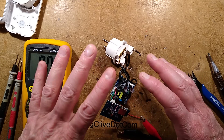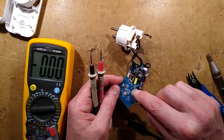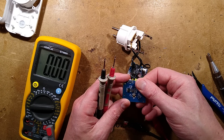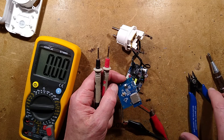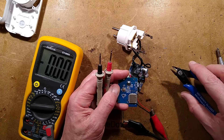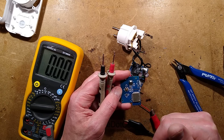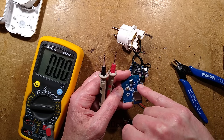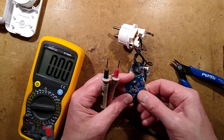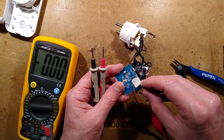The joints have been reflowed and some tests have been done. Sadly it's a fail. I'm getting 3.3 volts to the little module, all the connections seem good, it's just not doing anything — well, it is getting slightly warm. If I bridge these two connections here, it brings the little red LED on and the relay. But everything else is dead. The green LED is controlled from this when it boots up, and when it drives the transistor it doesn't just drive the relay but also drives that red LED. So I'm getting 3.3 volts to the processor — everything's there — but it's not working.